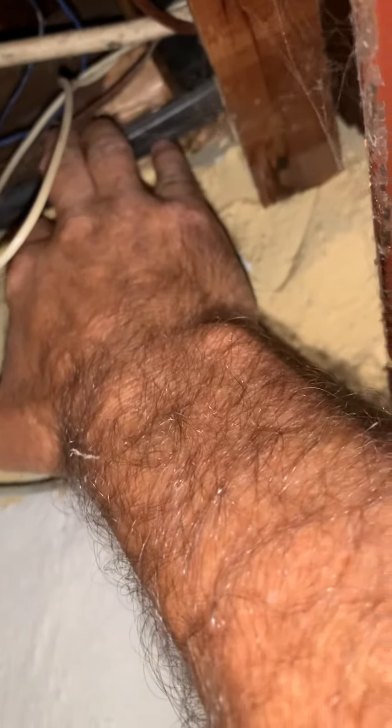Most importantly, we're replacing this liquid line. It's in a spot where there's some wiring, so we just want to hold this down a little bit, drill that out, and get the 3/8 punch through there.